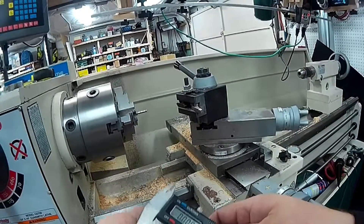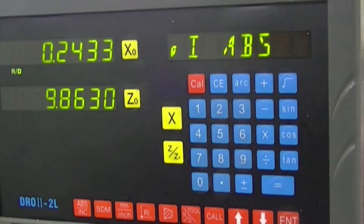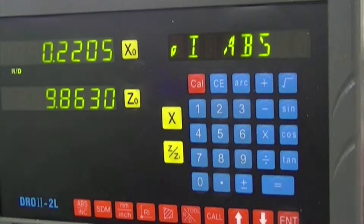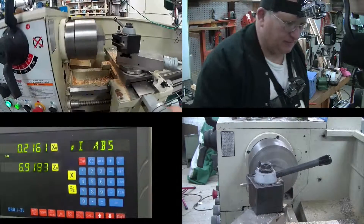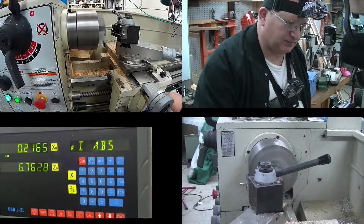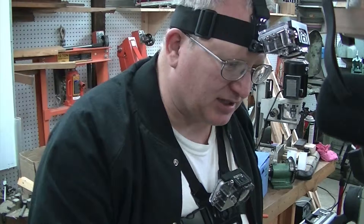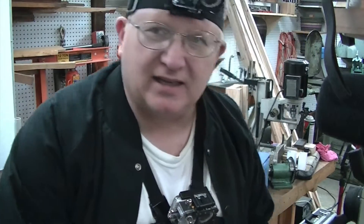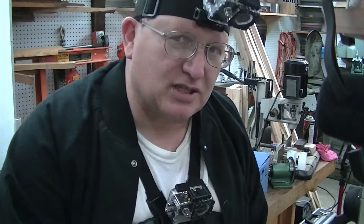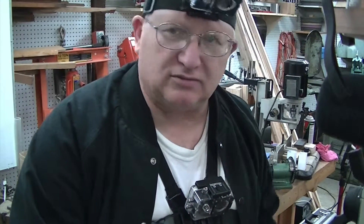We need a battery. Let's try again — 243. Okay, let's go down a bit. Now let's go to 216 or 217, and this will be our finished pass. That's for the inside diameter — this will actually go inside the 7/32nds K&S tubing, that brass tube. You can find it at a hardware store or a hobby shop in a display by K&S Engineering. 7/32nds OD, 14 thousandth wall thickness — I'll have to do the math when I'm not running the lathe.